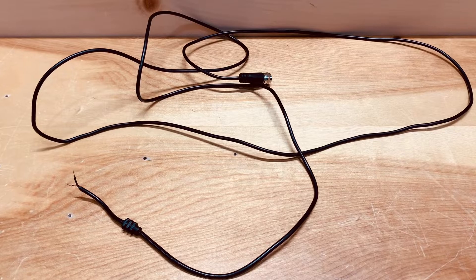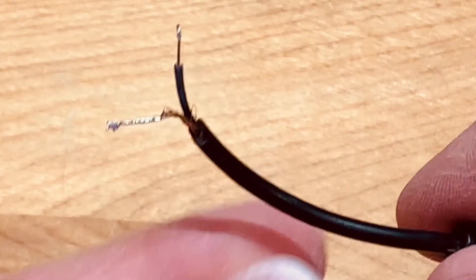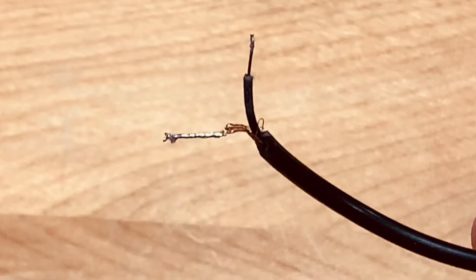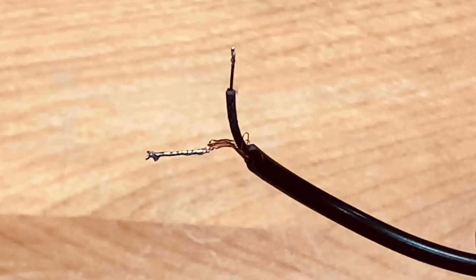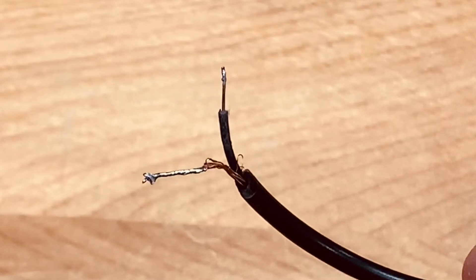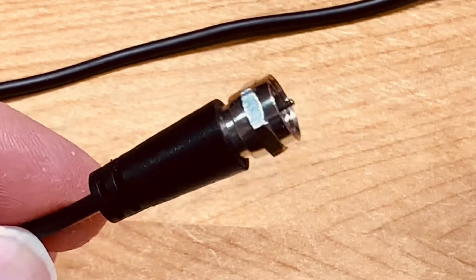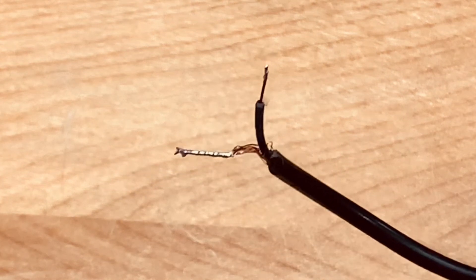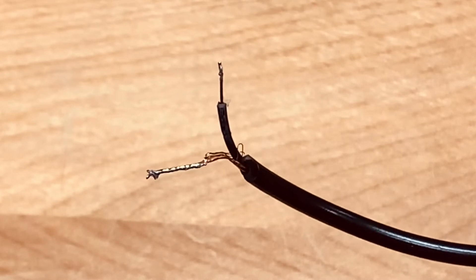Here's a length of that thin cable I took out of an old pair of broken rabbit ears. What you have is basically two pieces of wire — one is bare copper, and the other has a jacket around it — and those are both encapsulated inside an outer jacket. That's basically it, and that is what these indoor antennas are mostly using as coaxial cable, with an RF connector attached on the other end. This really looks more like speaker wire than anything — and probably if you used a heavier gauge speaker wire, that would protect your TV signal more than this.